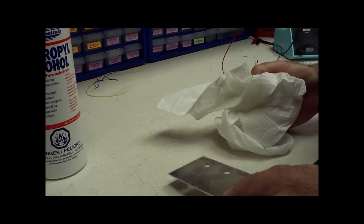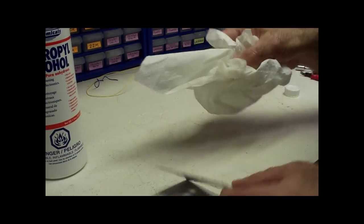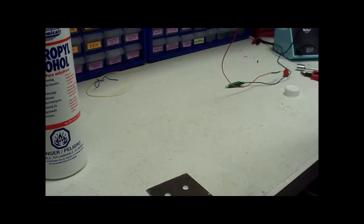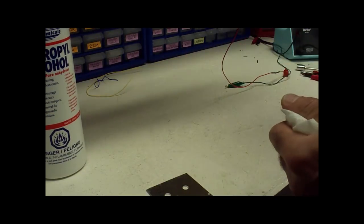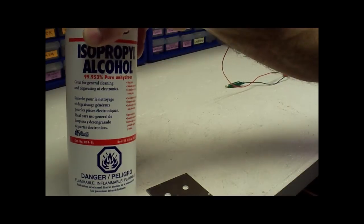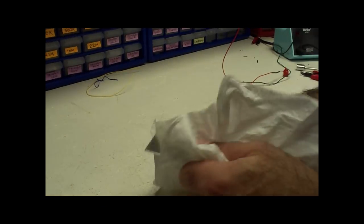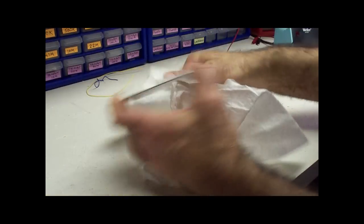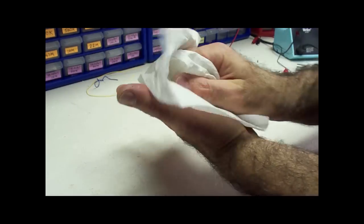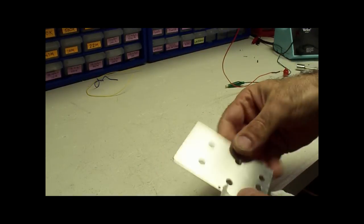So now we're going to clean the plate with some isopropyl alcohol. The less you get on your hands the better — it tends to dry your skin out. So I just wanted to give that a good wipe and dry that off. That's with isopropyl alcohol, which is also very good for cleaning circuit boards, by the way. We've dried all of the isopropyl alcohol off, cutting all the dirt and oil from the cutting oil and so forth. Now we're ready to go ahead and adhere the front panel template.